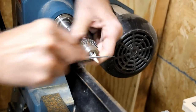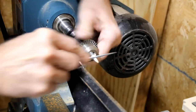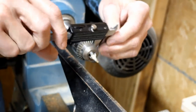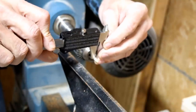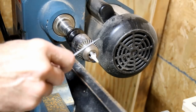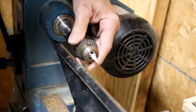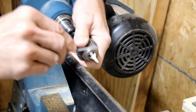To my eye that definitely looks better. Let's see what the measurement is — 142 thousandths, so we're getting closer, trying to go to 125. Now that took off some of the high spot, let's see if it'll turn better. Maybe a little better. 128 thousandths — so very, very close right there.